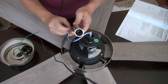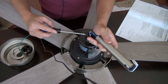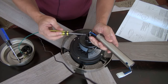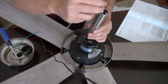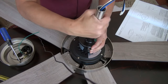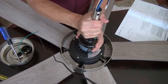Insert the wire through the down rod. You can loosen this first — this is going to require a flat screwdriver. Just loosen it up; don't take it off, so that you can insert the down rod in there, and then turn it clockwise all the way in, really tight.